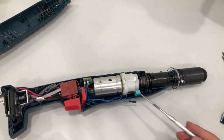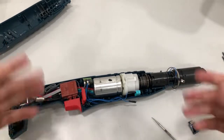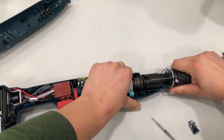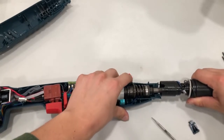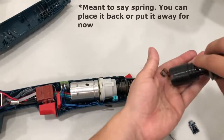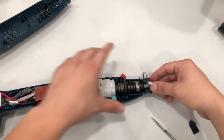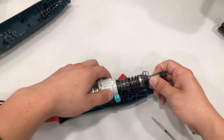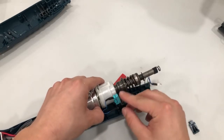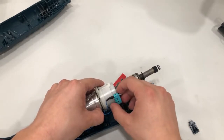It's a little more complicated than the switching element, which is the small plastic piece, but it's still pretty simple. The first thing you want to do is take the head off — push it in and it comes right off. There should be a small screw in there — make sure you don't lose that. Now you want to lift this off. I like doing it this way to ensure I don't press anything too hard or break anything, and it gives a better angle when taking the micro switch off.